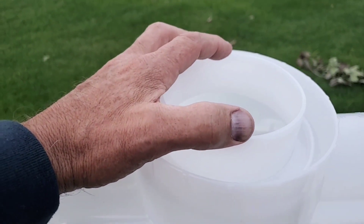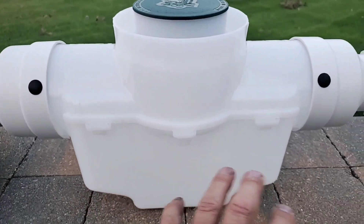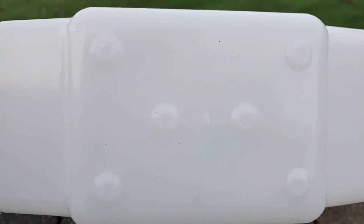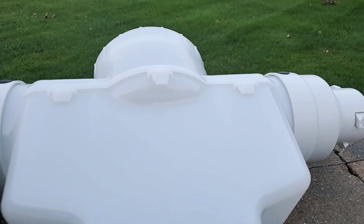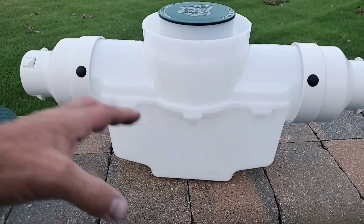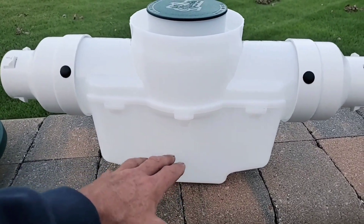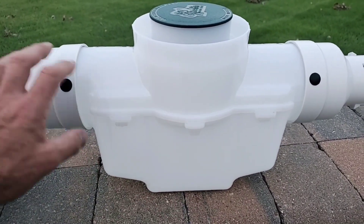You can use it in the four-inch version. We do make a solid plug because we don't want mosquitoes to breed in here. We also have a very convenient bottom where you can see holes for a drill bit — use a small drill bit and drill out those holes to whatever size you want. I encourage a small drill bit so during a rain event you're not leaching a lot of water. If you have very permeable soil, too big of holes will leach a ton of water during the rain. After the rain, small holes will drain it out in good permeable soil, but in clay it's going to take some time.